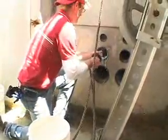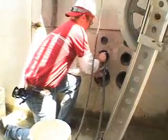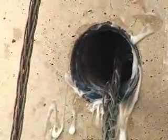Front end packs can also be used to pre-lubricate from the back end of the pull, where your puller is, to the front end of the pull, where your wire feeding end is, to ensure that the lubricant is present at the end of the pull where it's really needed. Shown here are the bags coming out of the other end of the conduit. Notice that the bags are empty and the head end of the cable glistens with lubricant.